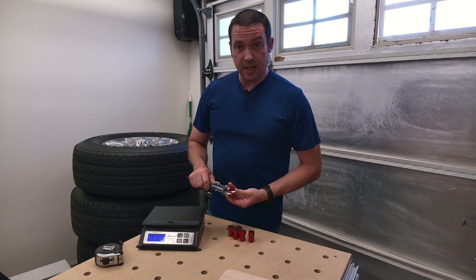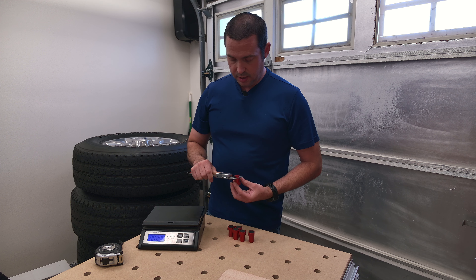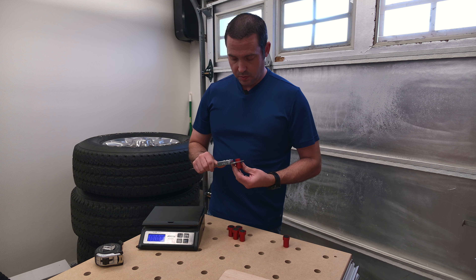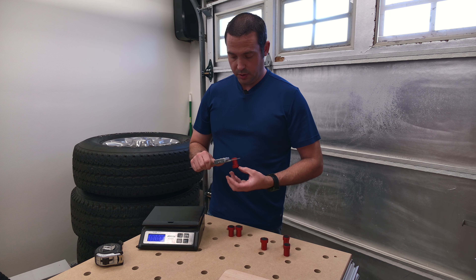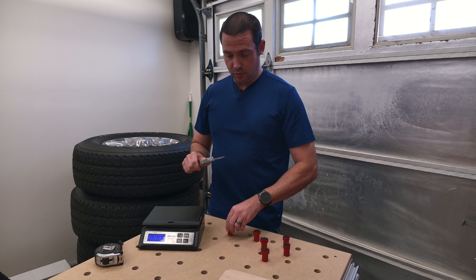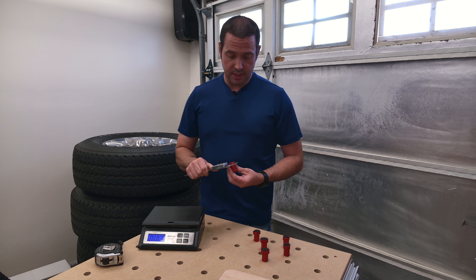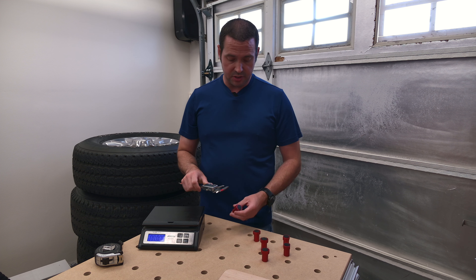The actual portion that would slide into your MFT table, I am getting 19.91 millimeters. That's pretty consistent — 19.91, 19.94, 19.92, 19.92, 19.93, 19.91, 19.93. So they're fairly consistent. 0.01 to 0.02 millimeters isn't going to make much of a difference.